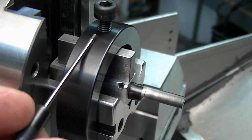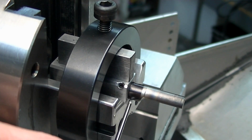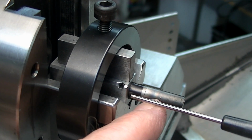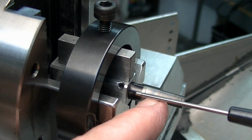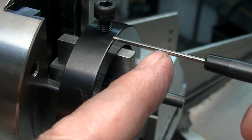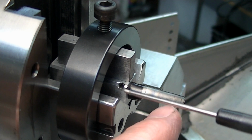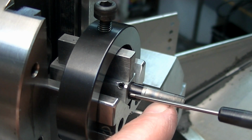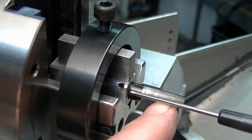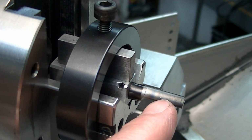But also the axial location this way of where this screw bears relative to what's bearing in the V-block has a huge effect on whether this points downhill or uphill relative to the axis of rotation of the punch grinder. So that is where you carefully position this and look for the midway point of the bearing area and snug it with the spreader. And then you can fine tweak if you have to tweak your axis just a little bit. If you're doing very, very precise work, you can get this to where what it's grabbing is not influenced by improper techniques with the V-block.